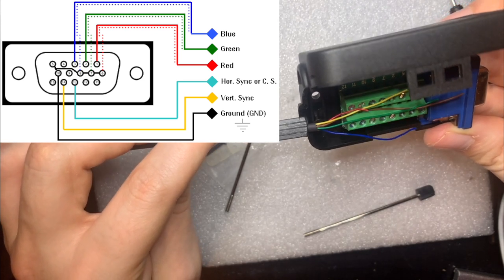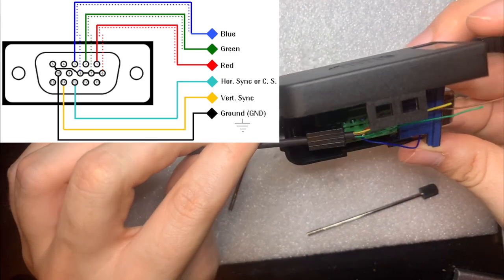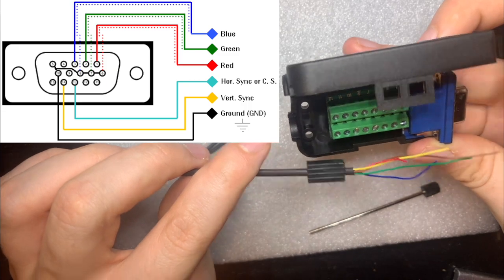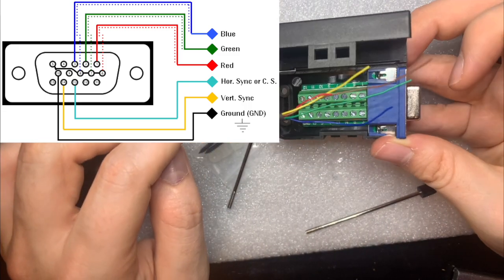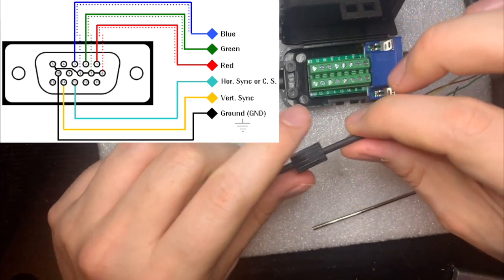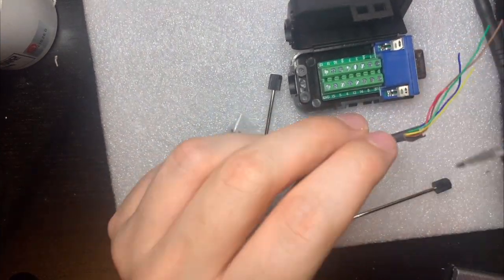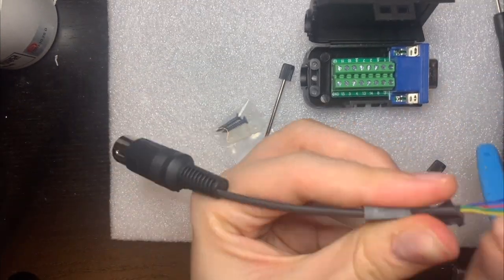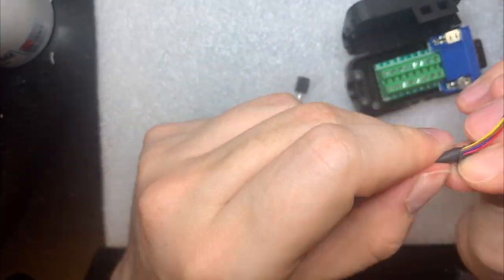Okay. So we'll have a lot of ground connections to make, but in particular this red cable, which is quite short, actually has to go all the way over to 1 here on the end. So that will be the tricky part. So I'm just going to make this a bit longer. And while I am using my wire cutters to do this, I'm being very careful to just cut the outer casing, the heat shrink wrap, and not the wires themselves. That would be, of course, very bad.